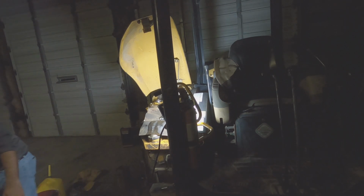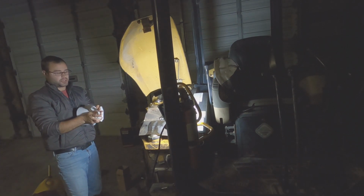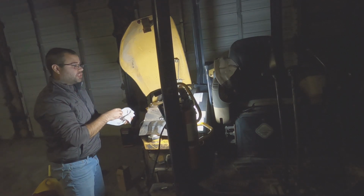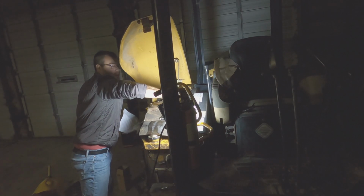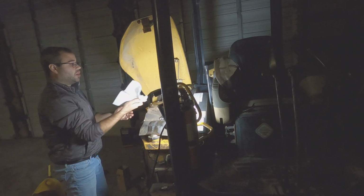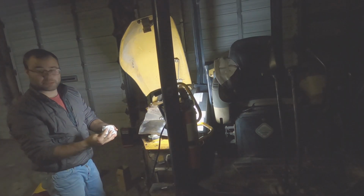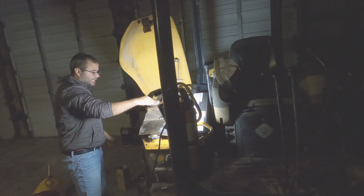Now, it calls for 7.8 US gallons on a system change. Where that's got us right now is above the third mark. But I was doing some research, and there's a certain configuration you need the booms in in order to check the fluid level. So I'm gonna start this up. I'm gonna put the booms in the orientation that it wants it in, and then we're gonna check the fluid again.